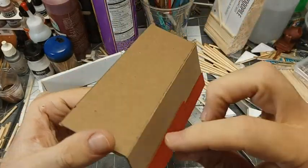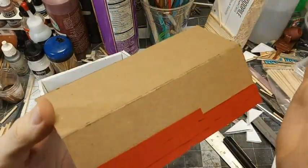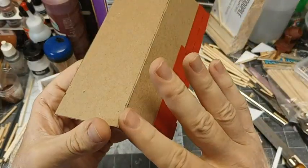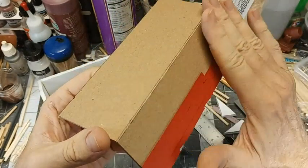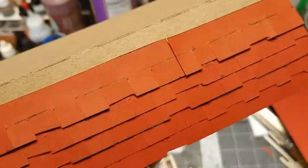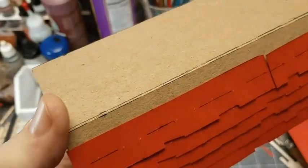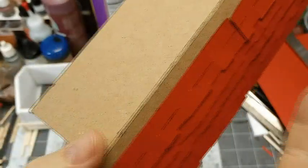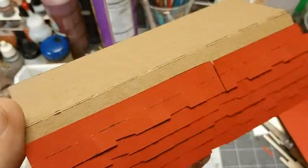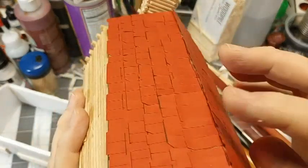When you get to the peak, a lot of times you'll see people make a kind of a ridge cover that's bent. They didn't do that historically because you can't really bend cedar shakes or any other kind of wood easily. So one of them will be higher and stick over a little bit to overlap. One of the things you can do to give it a rustic, rough appearance is to randomly cut some of the shingles at a different length and spread those out through there. And there's our roof finished with our proper ridge line.